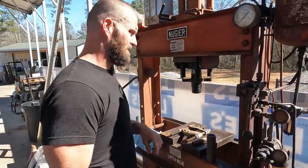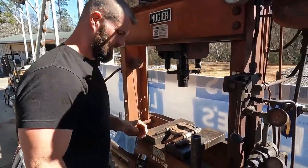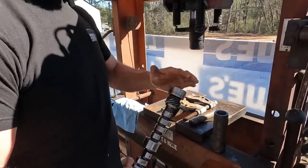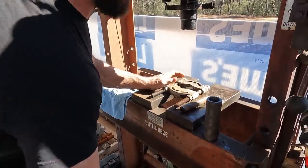Unfortunately we're outside and the sun's beaming on us — we're in a construction zone out here. I just got a standard bearing separator and we're going to get under the rear journal and press that journal off, then get under the gear and press the gear off.